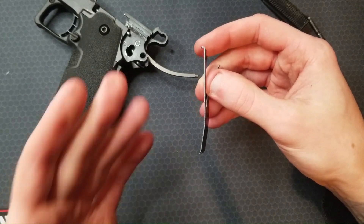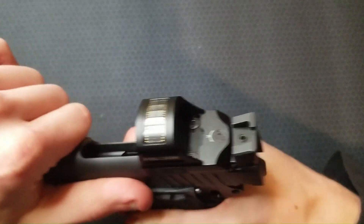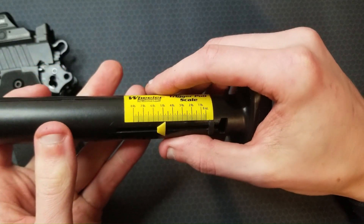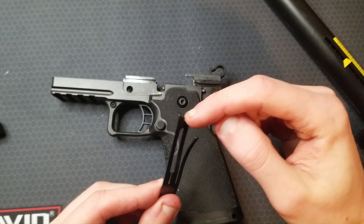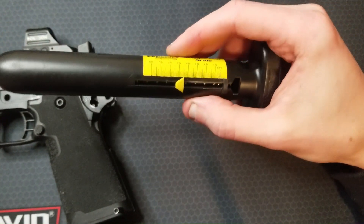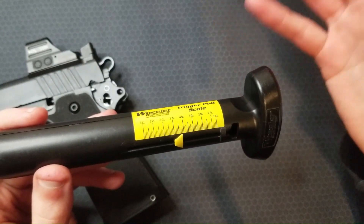This is the second aspect of the sear spring adjustment I'm quantifying — the left sear tang adjustment, which is of course the one everyone else measures as well. Remember, the left sear tang only affects break weight. After some adjustments, we're down to four and three quarter pounds, then four and a half pounds. If I'm having trouble getting break weight low enough, I may have to go back and adjust the middle sear tang again and retry. If that still doesn't get break weight low enough, it's back to recutting the sear tip and adjusting the engagement relationship with the hammer hooks. Final break weight is a smidge more than four pounds — that's fine. I'll check and readjust after a couple hundred rounds.